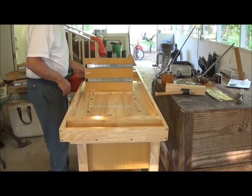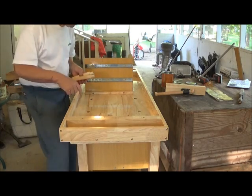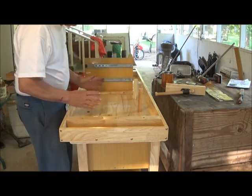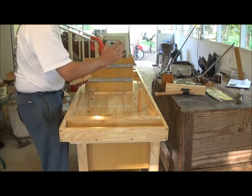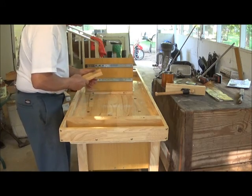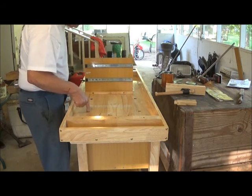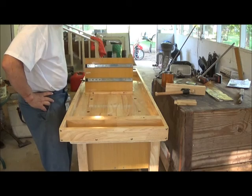But first I'm going to put a coat of polyurethane on this surface because we're going to cover it up shortly. We have four screws down the side to shoot in. These holes through the top are to fit these pins, and they are useful. However, they do allow any debris on the surface — like dust and anything else — to drop into the top drawers. Consequently, you might want to find some corks and plug these holes if you're not going to use them very often, as I surely won't, and I suspect most people won't either.